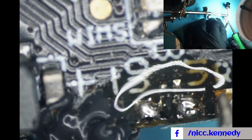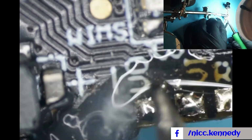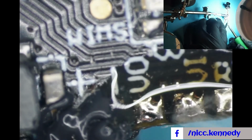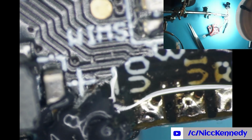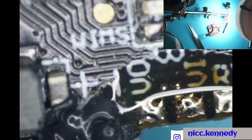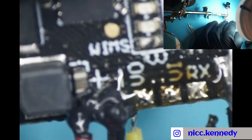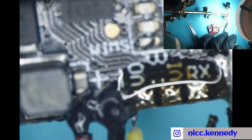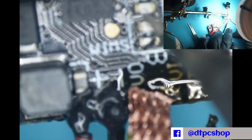To be fair and completely honest, as soon as we touch the iron down, the whole area looks all right, but we're just going to pull that off and put fresh solder on. So let's get our wick out. We're going to clip off the used stuff and get a fresh end. Let's see how big, ridiculously, preposterously stupid this looks. Remember, we can't jimmy that board around a whole lot because we don't want to lose that resistor up there.